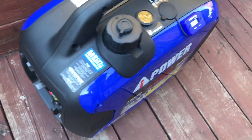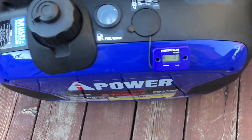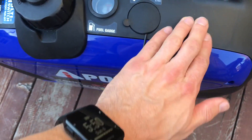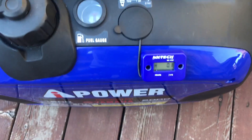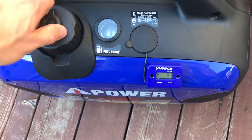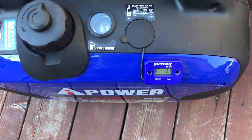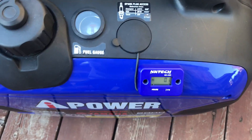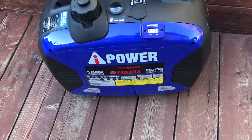It looks pretty clean. I'm not super happy with the cable management — unless you mount it right here and have the cable coming out right there. If you use 3M sticky tape right here, you could just have the cord come out right there. Learn from my mistakes. Overall, I think this will really improve the reliability of this motor because I'll actually change the oil when needed, and handle other services like oil filter, spark plug, and valve clearances. I hope to have this thing running for a long time. If you have any tips or recommendations for your Costco generator, or suggestions on what I should do to it next, let me know down in the comments below.